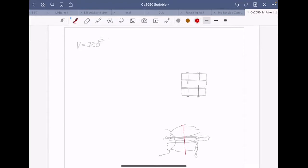So when you have these members and you want to connect them so that they move together, what you end up doing is that your moment of inertia actually increases. Okay, so the advantage of it is this. Besides the fact that we're trying to solve the question, why do we have to nail it? Why don't we just slip it together? I don't care if it slips. The reason is this: it becomes a moment of inertia discussion.